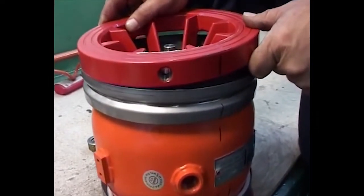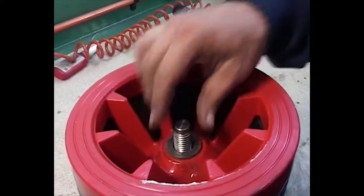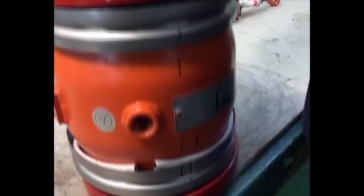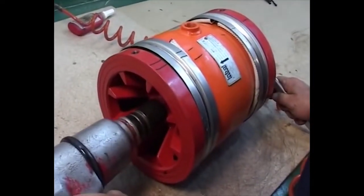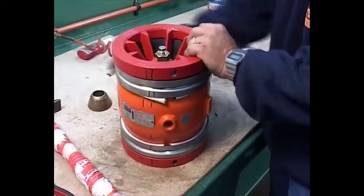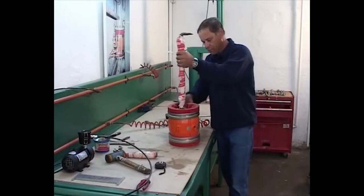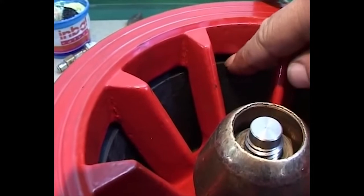Place the washer and the nut and tighten a few turns beyond hand tight. Place the metal cone over the shaft and use the crowbar to force the edges of the sleeve shoulders over the housing ends and under the cage. Push the edges outwards all around the cages on both sides.